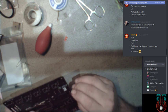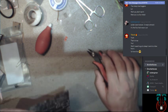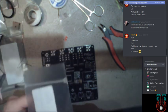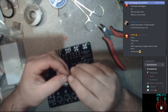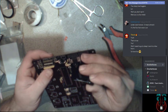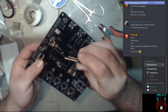But they're good for LEDs. Well, do they have the same compare register? I think so. I'd have to look at the code, but it's really funky. I didn't think they had that many compare registers. Anyway, sorry, I'm sidetracked. They're piggybacking off of one of the clocks. Like the clock multiplier then? Does the AVR? Because in an MSP, that'd be really easy to do. I don't know how you do it in an AVR. Anyway, the only pin you can't do PWM on is pin 2. Yeah, you can only do digital.